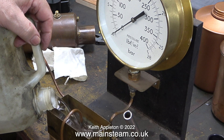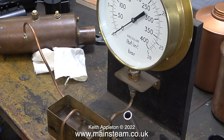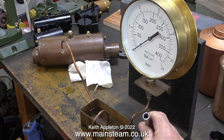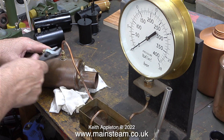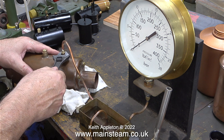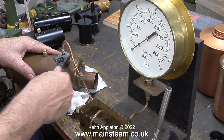Time to get out my boiler test rig. Here it is — I'm putting some water in the tank. Before connecting the pipe to the boiler, I move the pump handle to make sure that the pipe is full of water, and it is. It's obviously quite important to make sure that the union is tight, otherwise I will get a shower bath.